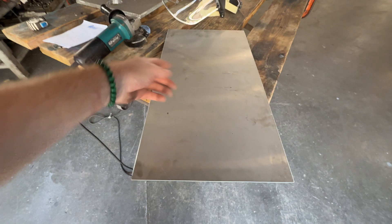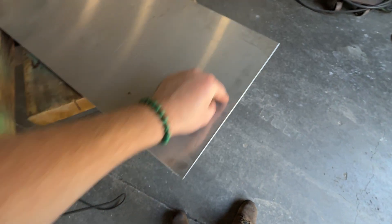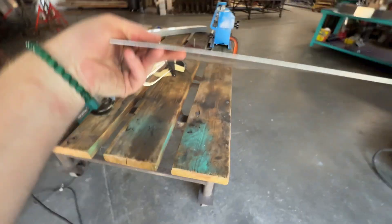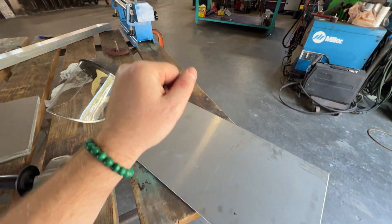I've got to make it one inch longer — half inch on each side, so half and half equals one inch — then hem it by folding that half inch in the brake and mashing it down the other way. That makes it a little stronger. There might be better ways to do it but this is our way, and we'll show you the process.